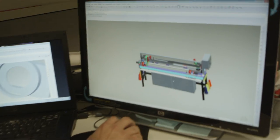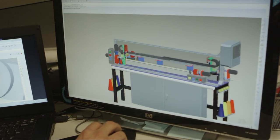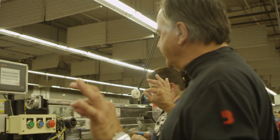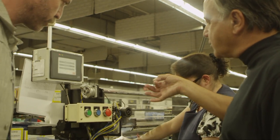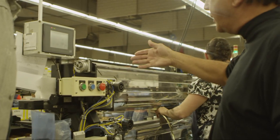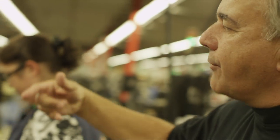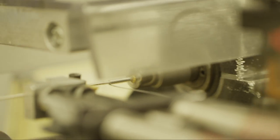The machine wound or computer wound strings that we make are extremely consistent because we control that in a precise way. She's putting a core on the string, and then the machine is automatically threading the wrap wire and winding the string. So it's wrapping many, many wraps on the string at like 22,000 RPM, very fast. Like a missile does on its course, right? It's constantly correcting its course.